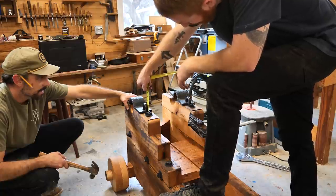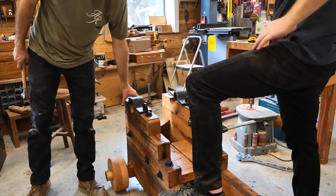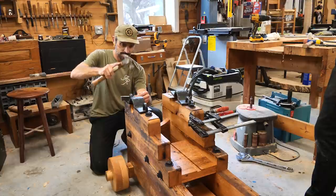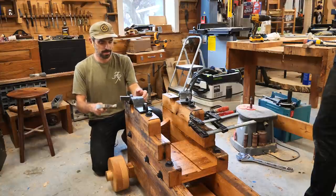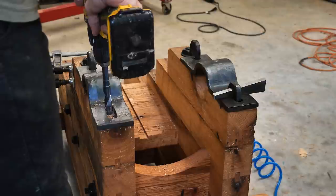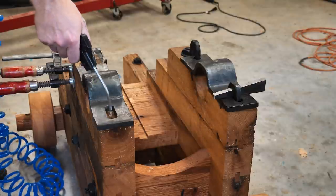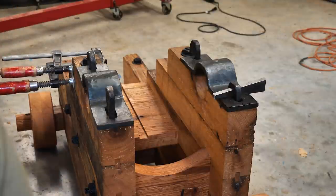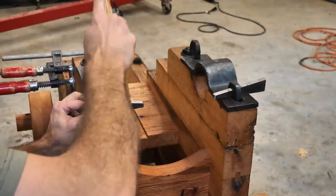The front spikes were scary — only about an inch from the end of the board, so very likely to split. What we ended up doing was drilling those holes fairly large and using high-quality epoxy — Total Boat's thick stuff — down in the hole to seal and grab the wedge. It's never coming out. Not ideal, but lesson learned. Really what needs to happen in future builds is threaded rod on these so they're mechanically attached. Never built a carriage before, so getting through it with this being the minimum of problems is pretty good.